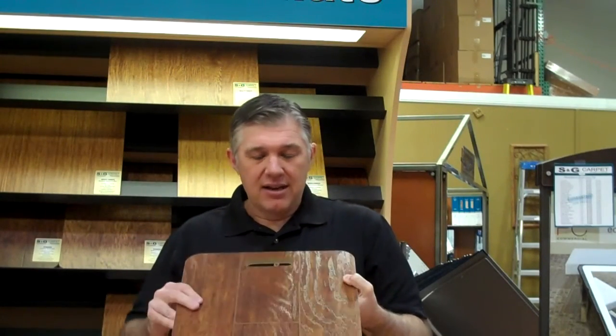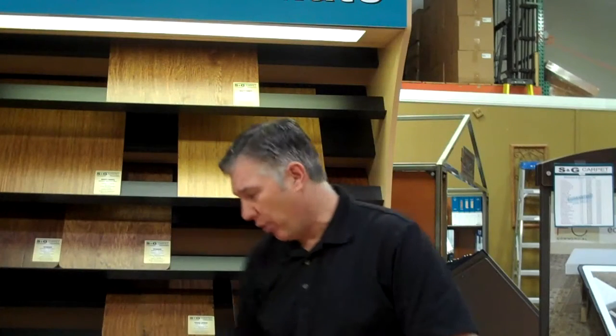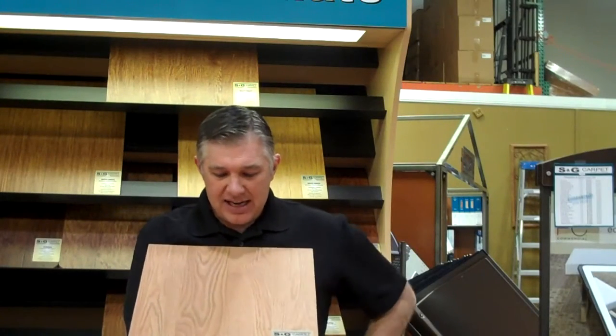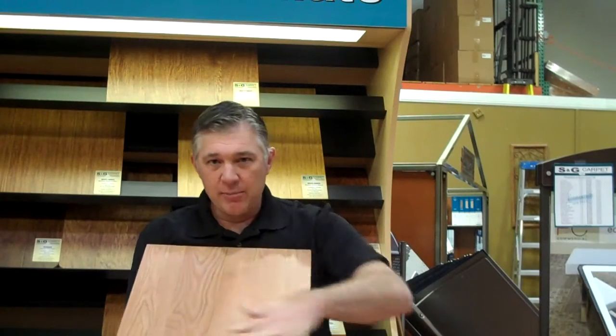Now conversely, people always ask, hey, why does laminate cost more? Okay, well, it's all about adding stages into the product. If you look at a cheaper product, like our Kingston, it doesn't really have any bells and whistles. It's just a square edge. This particular cap sheet is just randomly put over the top of the oak. So there's no extra added value. Whereas we have a textured cap sheet on the new products and a bevel or a pressed edge that adds in manufacturing cost, takes more time to produce, and the price gets driven up.